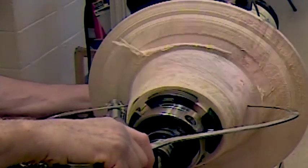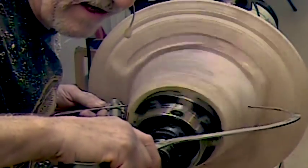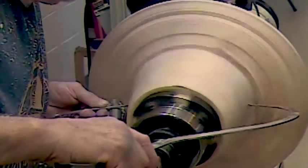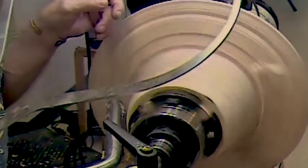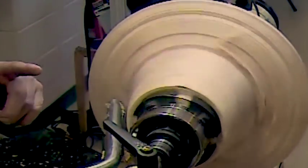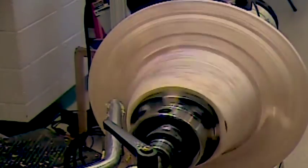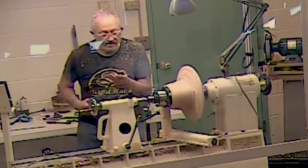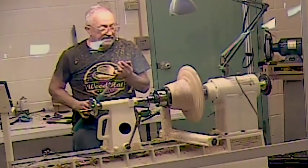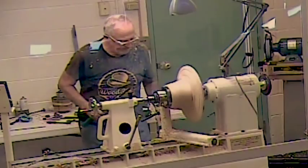So my size is still way up here. And I can put the center of the calipers over the tailstock. Both jaws are hitting the same place. So I want to pick that up and carry it down like a cylinder. That's going to be my band. But I'm going to do that with a sharp tool, half inch. The half inch in an 18-inch handle is the tool I use absolutely the most. And this is right off the grinder at home. Sharp as hell. I don't even have to grind it.